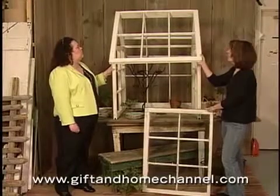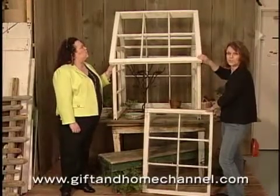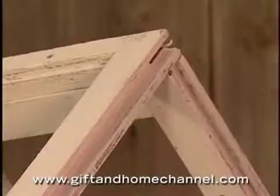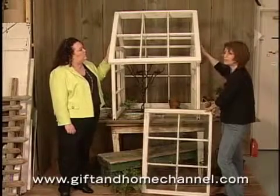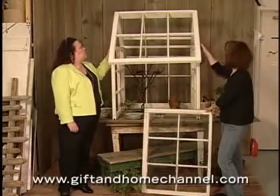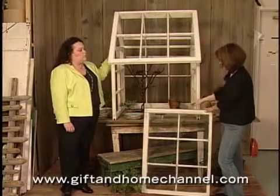And then you can assemble your top on the floor or another table, get it at the pitch that you want for the size of the base. Again, wood screws on the top. You can reinforce it if you'd like with another bracket. And then once you slip it on top of the base, wood screws through all 4 corners. And then don't worry about your screws because you're going to end up dry brushing it.